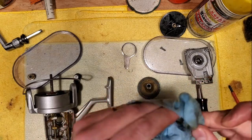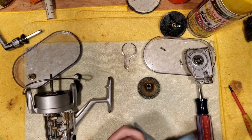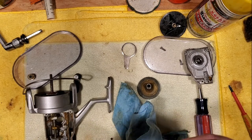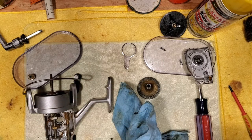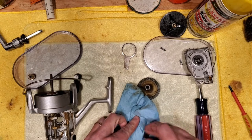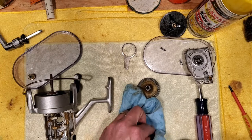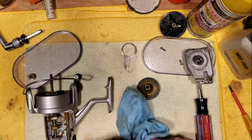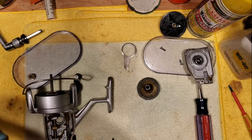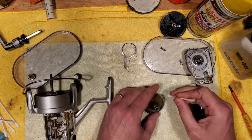I don't know for sure if there is an actual bearing in here — I'm suspecting it's probably a bushing, but we're going to get the rotor off and take the axle shaft out just so that we can say we did all that. First, we're going to clean up some of these pieces the best we can. This cam is not symmetrical and does have to go back on the correct way — this lever arm, you need to get that correct. We'll clean up our main gear and this bushing as well. This is just old grease — there's nothing in bad shape here really. So that's a good sign.